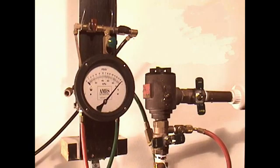When measuring the differential pressure across the check valve, the upstream and downstream shut-off valves are closed, the high-pressure hose is connected to the open test cock, the test kit needle gauge is at full scale, and the low-pressure hose and the test kit are at the same elevation as the vent bleed screw. The test kit high and low-control valves are closed and the vent control valve is open.